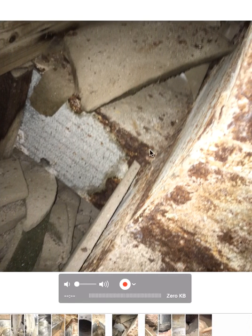This is nasty enough that this is a replacement. There's enough rust here that if it's this bad on the outside, you can only imagine what it looks like on the inside and how much of that metal and rust they're breathing in the air inside of the home. So that's a duct replacement there. Again, because everything hasn't been properly sealed, you see the discolored insulation.